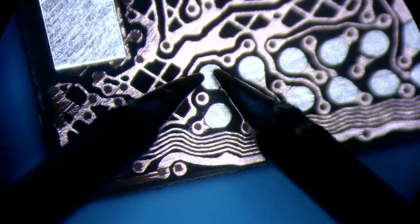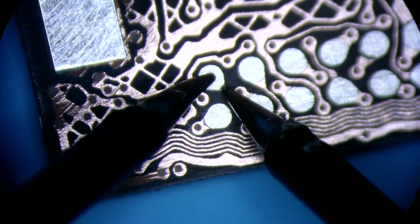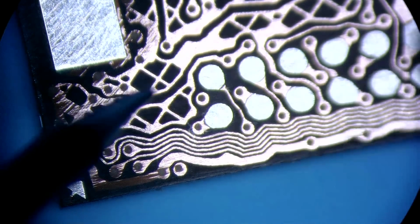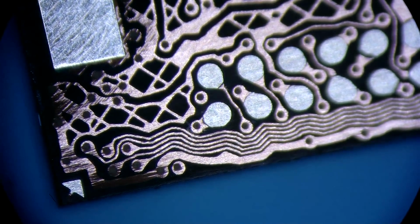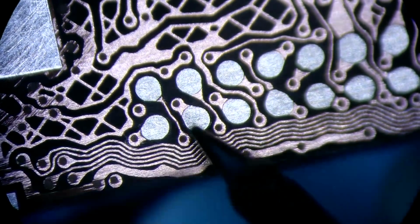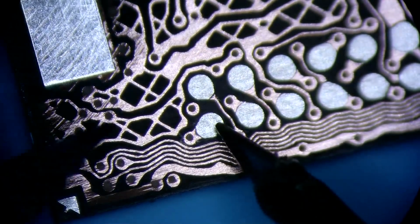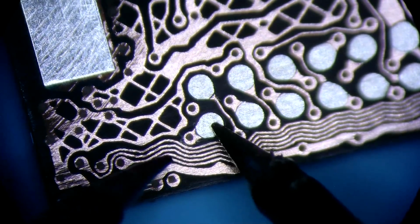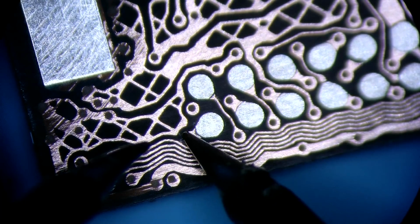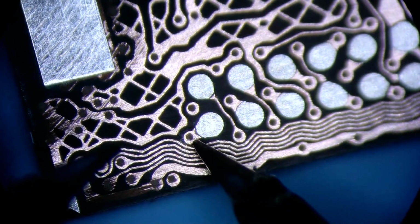This is again a point A to point B connection, but it's attached. There's still a fine line of joint in there that makes it whole. So this one is broken, but it's not critical. Why is it not critical? Let me explain. Because this test pad here is just so that we can access the data bus line here, which leads to one of the data bus signals.